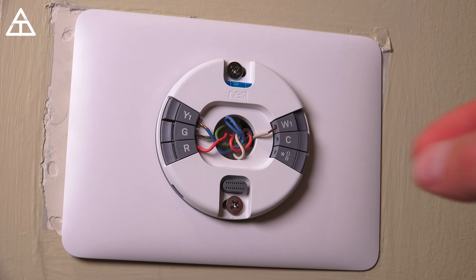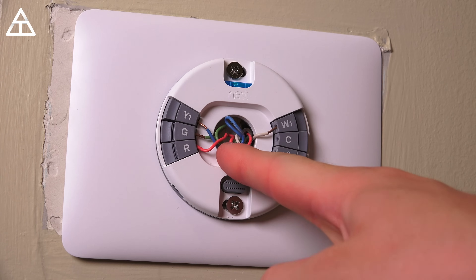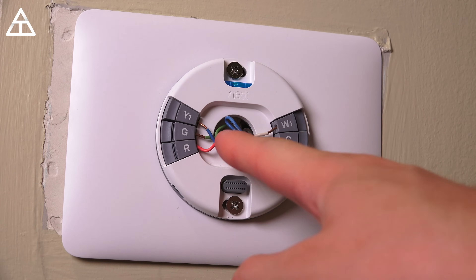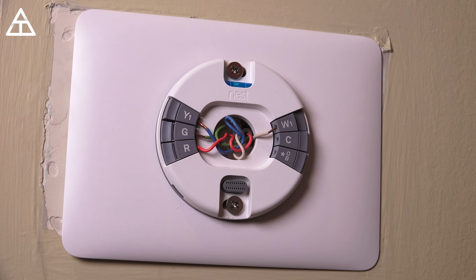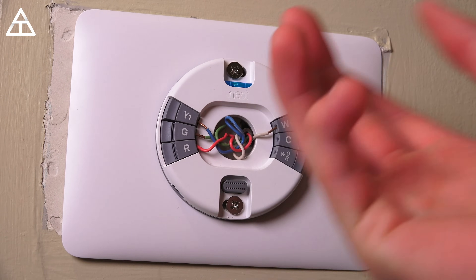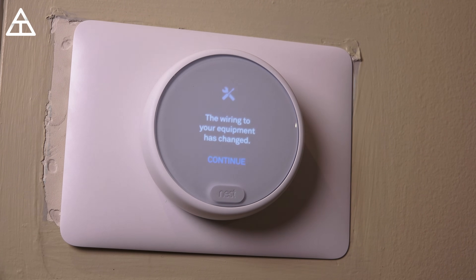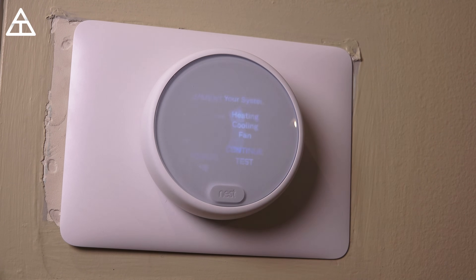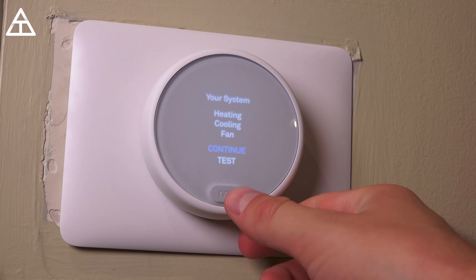I am new to this, so please cut me some slack. But it seems like the cooling wire — the blue wire — did come disconnected when I went to press in the Nest. That's why the cooling option didn't come up. So make sure that you take off the Nest thermostat if you have any problems and double check those wires. You'll see it recognizes that the wiring is different — I'm glad this happened because it might be an issue you run into. Now you'll see in the upper left the cool option showed up. I'm going to hit continue, and now we have heating, cooling, and fan. So we are good to go.